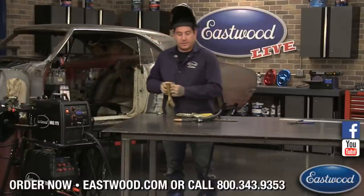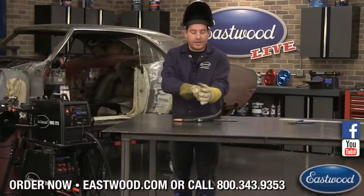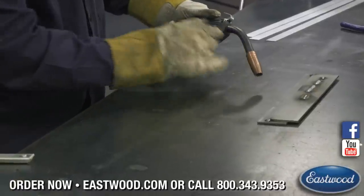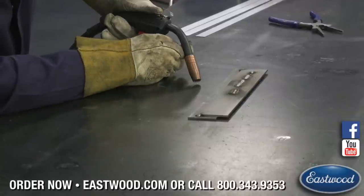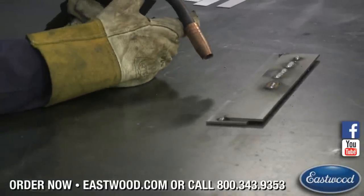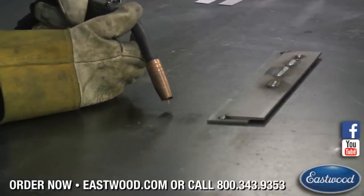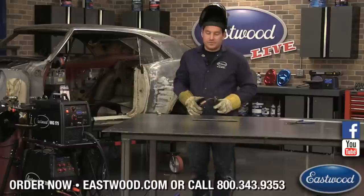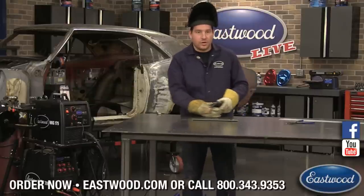You want to keep your torch turned. I'm left handed, so I'm going to weld left to right — I keep the torch turned back a little bit. That allows you to see the puddle, and you turn it at a slight angle so you can work across as you weld. For most instances you're going to be pushing, not pulling, but there are instances where you may need to pull.